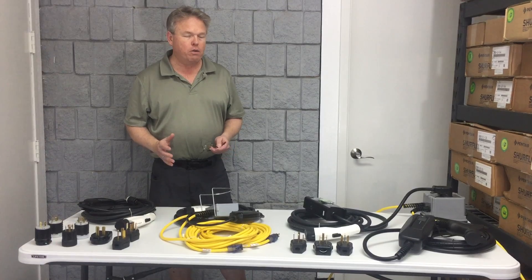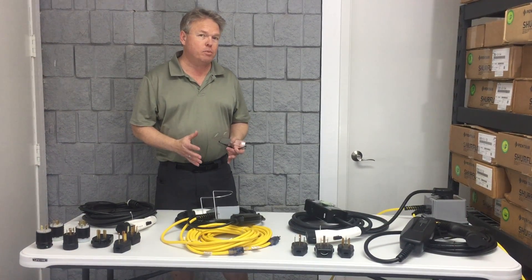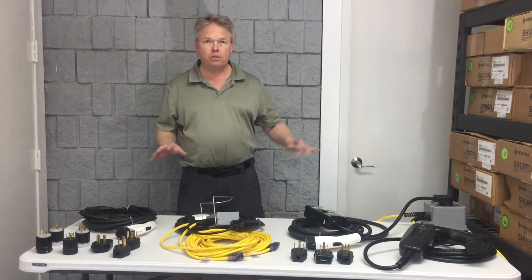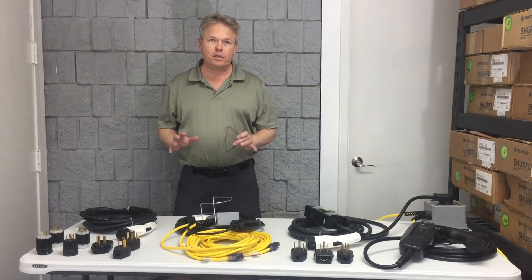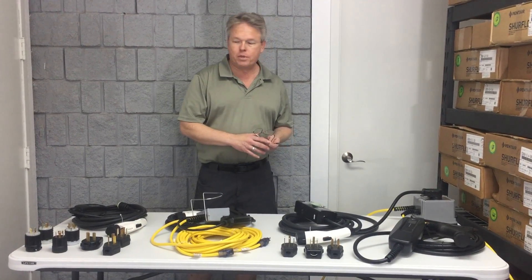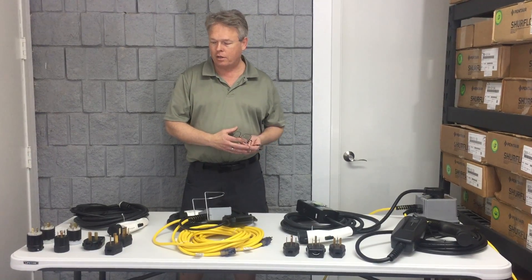The type of charger that you get with your car is referred to as a level 1 charger. It's 16 amps of power at 120 volts. These are all level 2 chargers. The level 2 chargers are all going to be 16 to 32 and even 40 amps at 240 volts, and are designed to charge the car substantially faster.